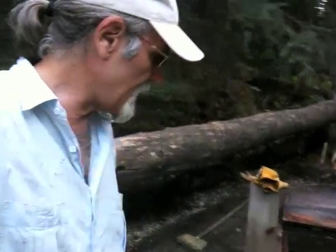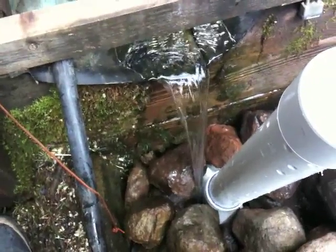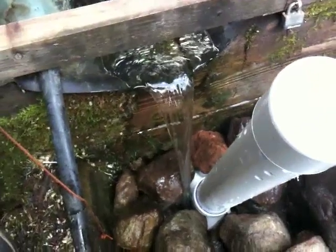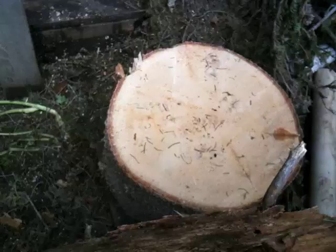Alright, so we've finished fixing the spring box. We've buried the new pipe here under these rocks to protect it. And it's all dry fit, but it's still quite sturdy because the rocks are all supporting it. Generating 25 amps of continuous AC power right now. Still a little bit of water left over — that's maybe another five gallons a minute, which would probably give us another four or five amps. But I don't need the power so we're just leaving it as it is. Going to rebuild the box today, and be done.